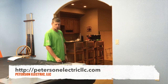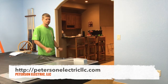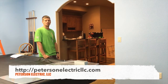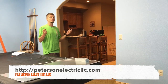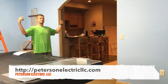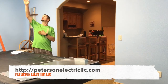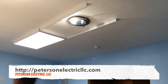These are wonderful when you're doing a drop ceiling. These fixtures weigh probably 1/10 of what a drop ceiling fluorescent would. Keep in mind that LED is typically 50,000 burn hours if it's worth its salt. Whereas with fluorescent T8 bulbs, you can get LEDs in those as well, but when we retrofit those, we use the old sockets with the fluorescents, and sometimes those tend to burn out or the wires get loose or they start to crack on the tombstones that hold the bulb. So this is a great application, and look how smooth that looks. That is such a perfect smooth light all the way across, no diodes.